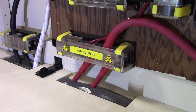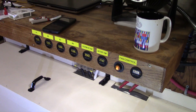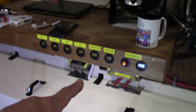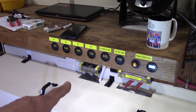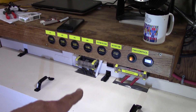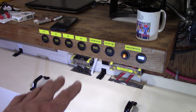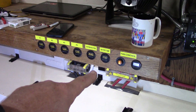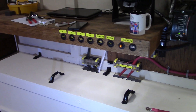The system is running good. My issue isn't necessarily with the batteries down here. The cooling is excellent with that small fan I replaced instead of the crazy loud 200 CFM 120mm 12-volt fan I had before. This is just a quieter one, probably 50 or 60 CFM, and it does excellent. It's about 94 degrees here in the garage and this thing was sitting at 80 — well within specs.